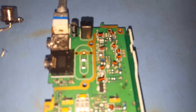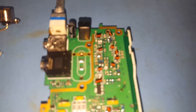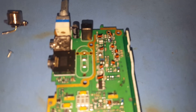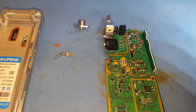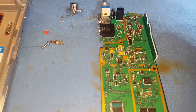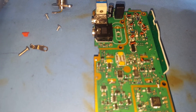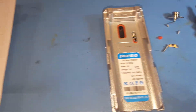In short, they tried to widen the passband of the VHF low-pass filter. That's why it's giving out lots of harmonics on the VHF band. The UHF low-pass filter I believe is still the same, which is why it gives better harmonic rejection on UHF than on VHF.